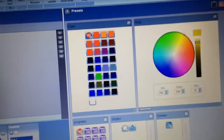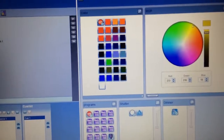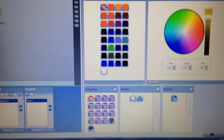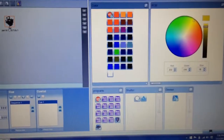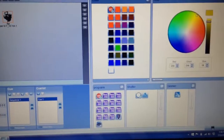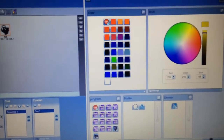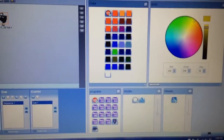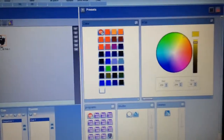Sometimes we'll have customers that don't want a color for their uplighting. They just want to brighten up some of the corners, some of the columns, but they don't want to necessarily do it with a purple, pink, blue, red. They just want to warm up the room a little bit. So off-white is a good choice for that, or an amber. But with those colors, like off-white, depending upon the surface that you're shining the light on, sometimes they can end up looking more green than they would on a wall that's just a flat white. Sometimes they've got some beige in there, which kind of greens it up a little bit. So sometimes you got to adjust the code a little bit.